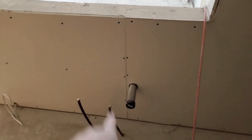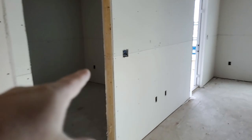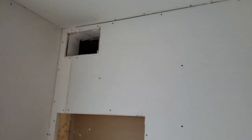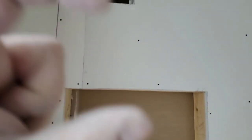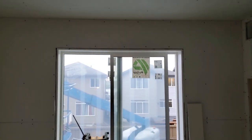Make sure, when you're doing your walls, anywhere you can do a stand up to minimize a joint. Like this is behind a cabinet, so it doesn't have to be taped, right? Now there's no joint across where the plug is, or the switch, sorry. Switches are all 48 inches, so they always end up in the bevel joints, so that's a pain. But like for example here, you make sure the joint lands somewhere where the tape joint will be small. Right, but yeah, looks good.